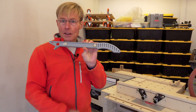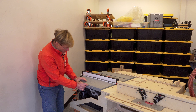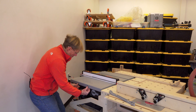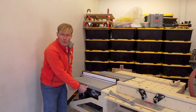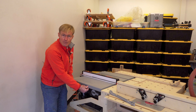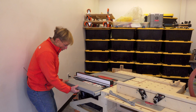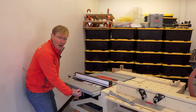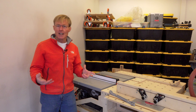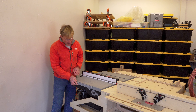Then I put the washers on the magnets and held the push stick against the table saw to figure out right where I wanted those washers to go. I made little marks, then popped the washers off and put the epoxy on, placing them right at their marks. Even then they slid a little bit, so I pulled the table saw out to give myself clamping room and put a couple of clamps on. Even though it's a five-minute epoxy, I left it for an hour or so — it sets in five minutes but is completely cured in about an hour. I've been using it now like this for weeks and haven't had any issue with the magnets pulling the washers off, so the epoxy is working well.